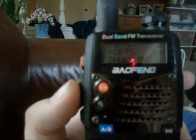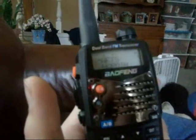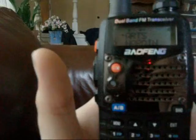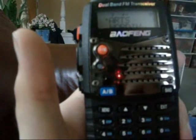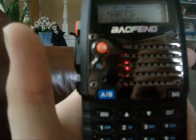Alright, well, I just had a conversation there with Don, who's the president of our club. I'm the vice president. You heard what he said about it. The audio's a little bit low on this, which might be remedied by widening the microphone hole on there, but I'm not willing to try that right now. I don't want to risk damaging the radio because I don't have the tools to take this thing apart. It's got these little hex bolts on here, and you require an Allen wrench or a teeny tiny hex driver or something like that to get them off. So I'm not going to try to do any modifications to the radio while it's assembled, because I don't want to risk hitting the mic element there.